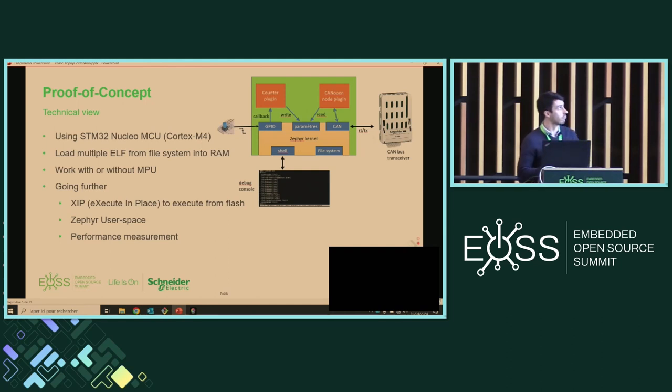I will do a quick summary. The target was configured to be a slave on the CANopen stack. We use our host computer to be the master on the CANopen stack. And the CANopen stack on the target itself is supposed to be an extension. So we took the code in Zephyr. If you look at modules, which are external modules, you can find the CANopen node, which is open source. And instead of building it inside the firmware, we built it as an extension. And we wrote another really simple extension, which was a counter, incrementing a counter each time a CAN frame is received,